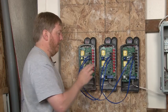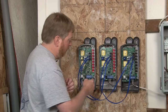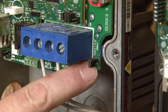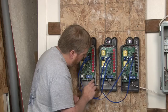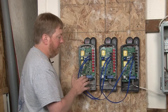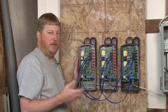The only thing you have to do is designate a Master Classic for things like battery temperature sensor and ground fault. So on the Master Classic, we need to put on the ground fault jumper if we want to use ground fault — that's in the manual and well described. Basically it's this little jumper right down here, and it goes on both pins like so. Now ground fault is activated. Battery temperature sensor plugs in here on the Master, and we need to remember which one we considered our Master for those two devices because we have to program that accordingly later.